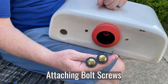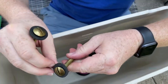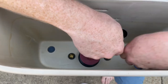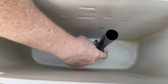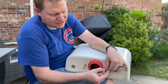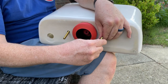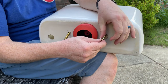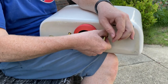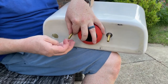These two are actually what I use to attach it to the toilet. Let me show you where this goes inside. They have these little washers on it — you'll want new ones because the old ones were super corroded and really bad. You want to make sure that this overflow valve is not in the way of those holes when you put that in. So that's what it looks like when it goes in. And then these you just put on like this, and this will hold these screws in. You need one washer and one nut. When you put the toilet on, we'll do another one on top of this.